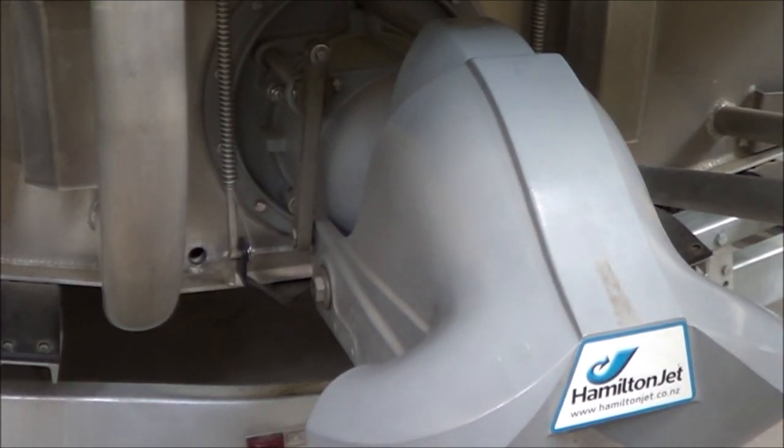So the question is, why not? Certainly that's handy, because that means the bucket isn't going to blow up on accident. And when it's up and it's difficult to get started, that means it's not going to fall down on accident. So the question is, why are these handy things happening? And the answer is in the helm, because this is a single lever helm. It gives us a certain amount of cam over. So let's go take a look.